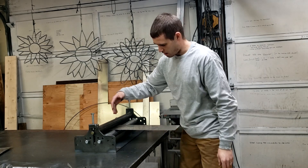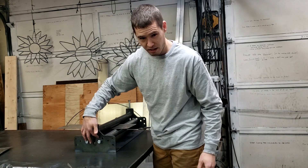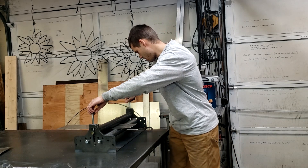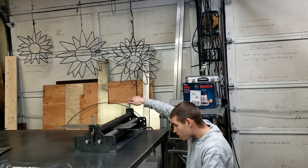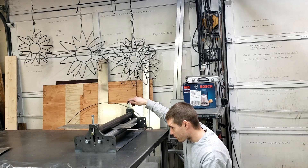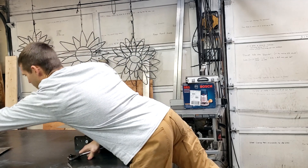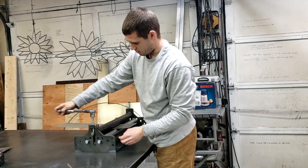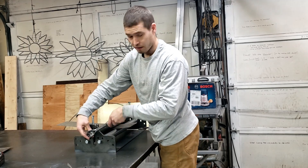This is the adjustable position roller and I have one sixteenth inch thick stainless steel sheet here in the second closest position. Put it on center, make sure it's straight, then tighten your adjuster bolts so that the top roller is level. Look right through here and you'll see a light gap between them — make sure it's the same on both sides — then take your ratchet and tighten it down one full turn, and start rolling it back and forth.